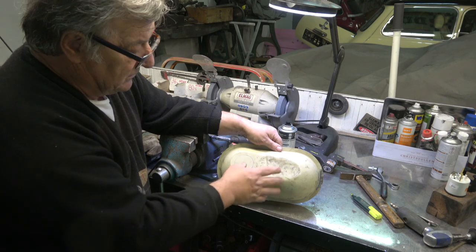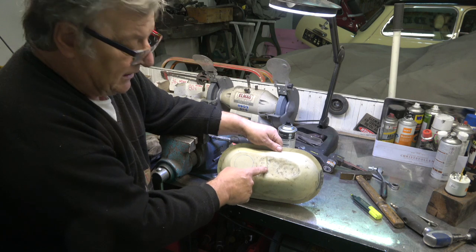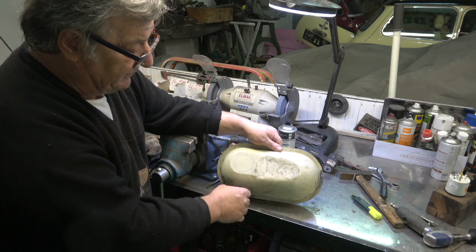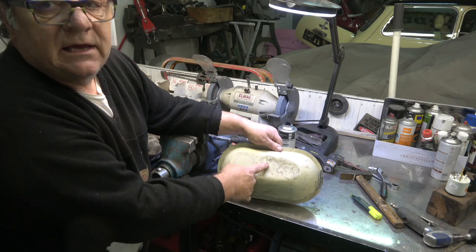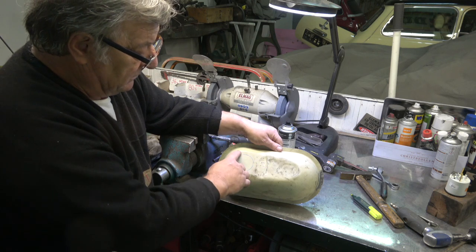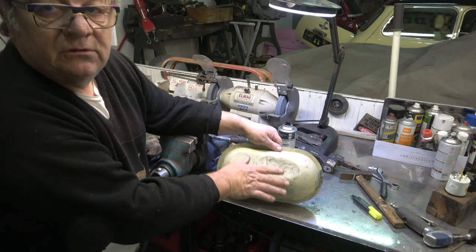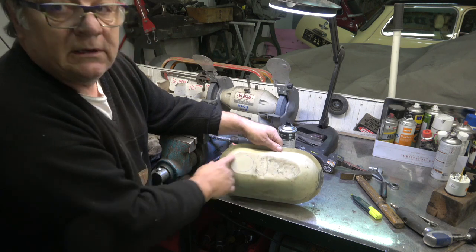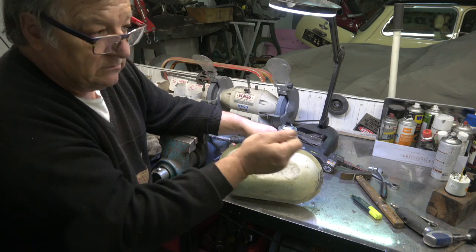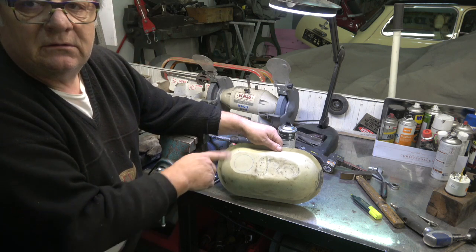So, there's many ways to skin a cat, as we've said many times, but by the time I actually get rid of this crease, I can't put this in my shrinker, the jaw is not deep enough for it, but I could probably get this out with the English wheel, but it would take quite a long time. So what I'm going to do now is measure this up, cut it out and put a brand new flat piece of steel in it, and then I'll weld it in place. Obviously I'll make the binnacles first, because then I can put them into the drill press and so on. So that's the next plan, and I'll show you when I get this cut out.